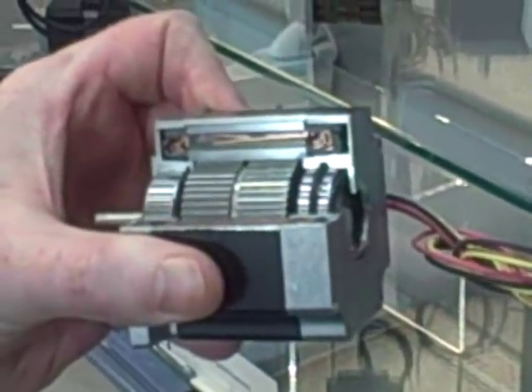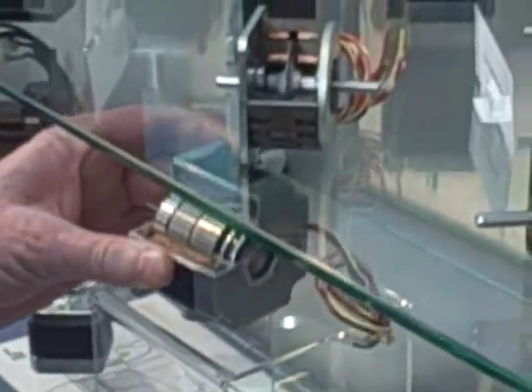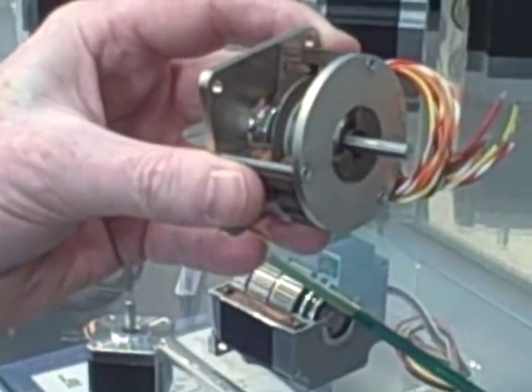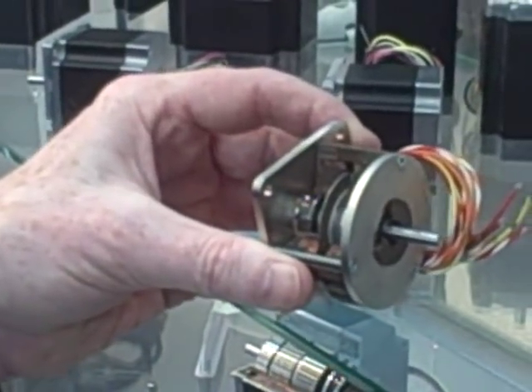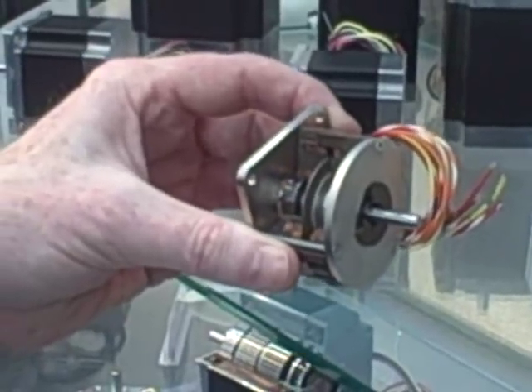This is a very special design. What we have essentially — instead of, as in the case of the hybrid motors where the magnet sits between the laminations — we have in this case simply a disc magnet. The disc magnet has got multipoles on it, and we have very short magnetic circuits. The consequence of both of these things allows us to produce very high acceleration rates and speeds up to 10,000 RPM.